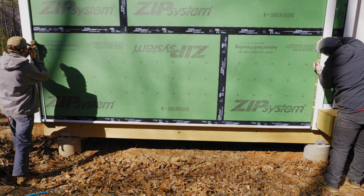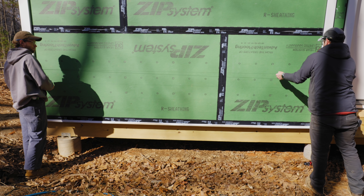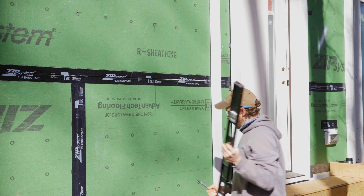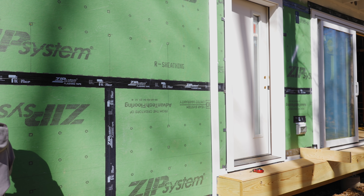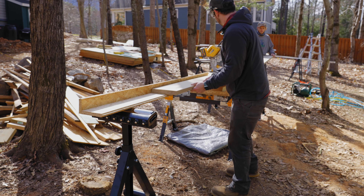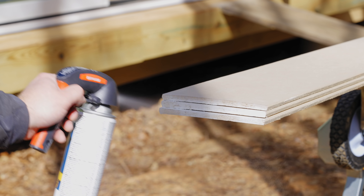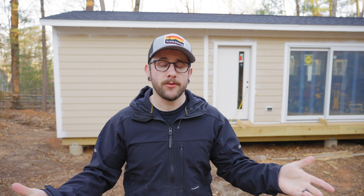Next we marked out locations for chalk lines on this first wall. This lap siding is about eight inches tall and we went with a seven-inch reveal, so we marked up the wall in seven-inch increments and chalked lines across those marks. The sheathing we used had stud locations marked on most of the panels, but we extended those marks where they'd get hidden after adding rows of lap siding, using a level to do that vertically. We measured up the first two feet of the wall to see if we could cut multiple boards at the same length — luckily our trim boards were pretty parallel so we cut three boards at once and primed all three ends at once.